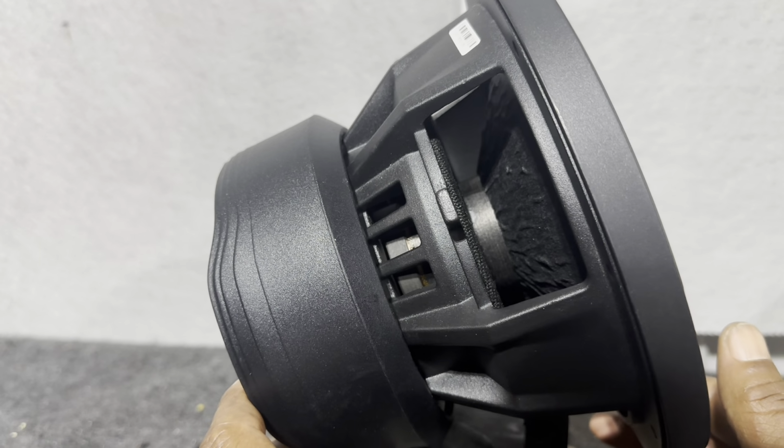However, it has a frequency response that's quite high. Let me pull it up. They don't have it listed on this driver. It has a very high sensitivity, 89 dB per watt, and maybe that has something to do with the voice coil. The frequency response is 50 to 1.5 kilohertz. Now, that's pretty high. Normally, a true subwoofer would be maybe 500 hertz top. 1.5 kilohertz is way up in the mid-bass region. As you go higher in sizes, like the 10 and 12, the frequency response drops substantially. The 10 is at 36 to 1.5, and the 12 is at 29 to 1.5.